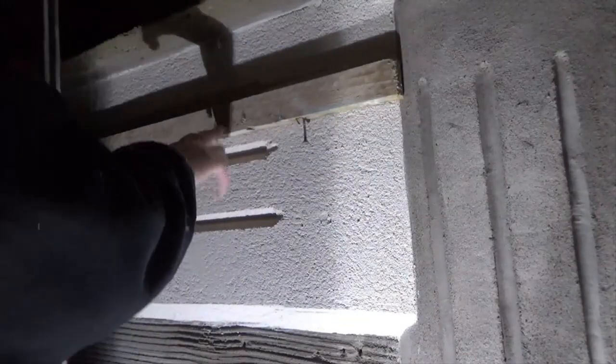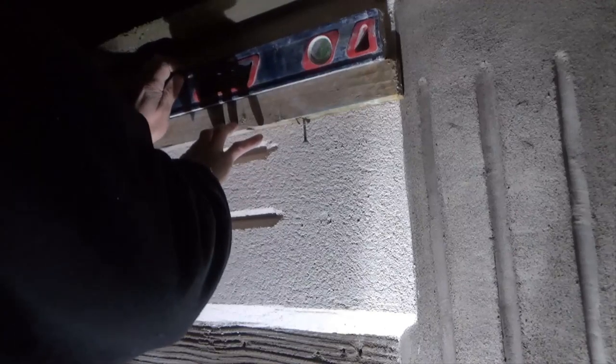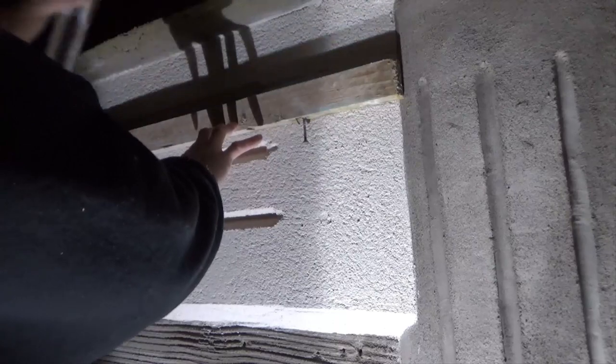And also, if you really wanted, you can tack the battens on and just fill in the holes the masonry nails leave as you pull them out. That would be the most sensible thing to do on the likes of a big large gable, obviously with an extra set of hands to help you hold. But get it all plumbed up and lined up around the house, wherever the measurements go, or whatever you've decided if you're doing your own project, and get it all plumb. Nail it on as you go, just as you would on a satin cement render plinth or base or bellcast. You're going to dash out round, so basically the same idea.